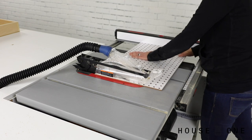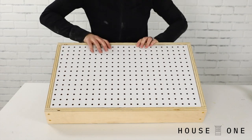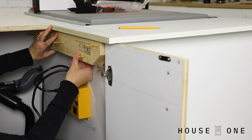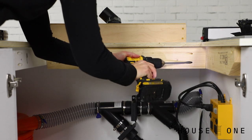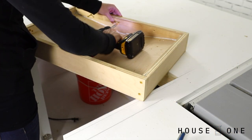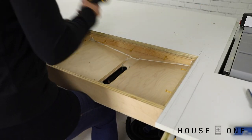I made a few trims with my table saw and then dry fit the pegboard in place. Now it was time to install the box in my mobile workbench. To do this, I added some 2x4 supports along the side and back of the opening using pocket holes. I prepped the inside edges of the box with pilot holes and screws, then positioned the box and sunk the screws into the supports and sidewall.